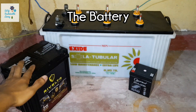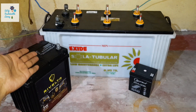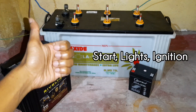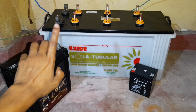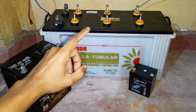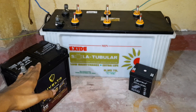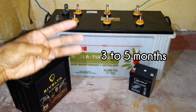The commonest and cheapest battery available in the market is the standard 12 volt car battery. These batteries are available worldwide even in the most remote areas. But the problem with these batteries is they are meant only for starting a vehicle — for the lights and ignition. They are called SLI batteries and are not meant to be discharged more than five percent of their rated capacity. If you discharge them more than that, their lifespan drastically comes down to around 100–150 cycles. They can be useful in short-term emergencies, but if you go into deep discharges daily, their useful lifespan drops to around three to five months.